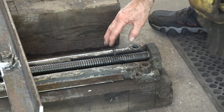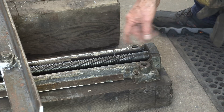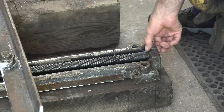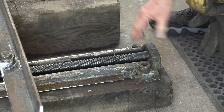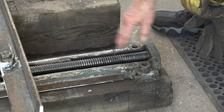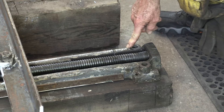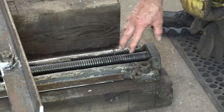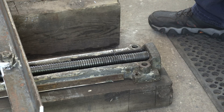I set this all up on blocks and I've got this piece where it's actually going to be when we fix it. We're going to examine the chunks and make a decision. I'm going to tell you why I leave or don't use those pieces. This is pretty greasy, so we do have to do a lot of prep work. But the main thing is we need to have that and this piece all by themselves so that we can work that whole area 100%. We've got to make this brazing a 100% connection for it to be back to its original strength.